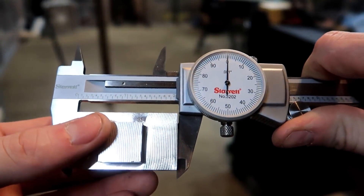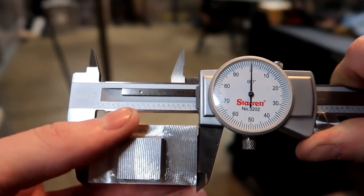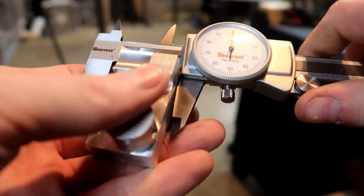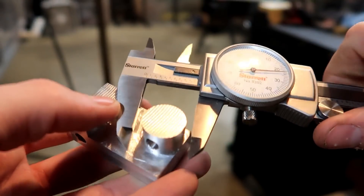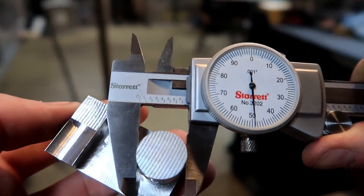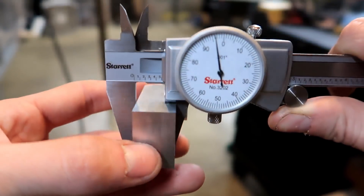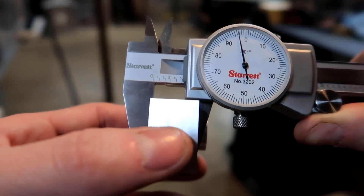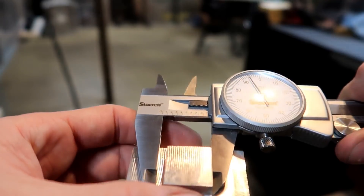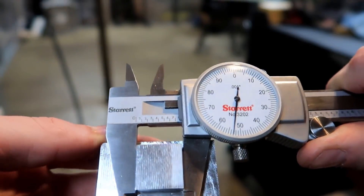What fun would this be if we didn't measure it? Supposed to be two inches — it's almost right at two inches. These aren't calibrated but they're pretty close. This is supposed to be an inch and an eighth, so we're about three thousandths under there. This diameter is supposed to be three quarter — fairly close, about a thousandth under. This thickness is supposed to be right at a half inch and we're about four thousandths under — that's probably the worst so far. This little square piece on top is supposed to be three quarter by three quarter — not too bad there.